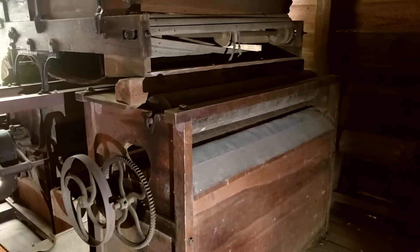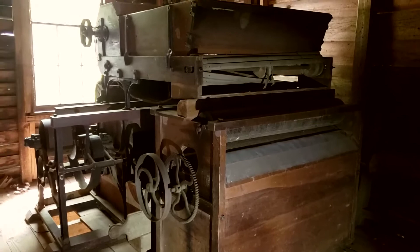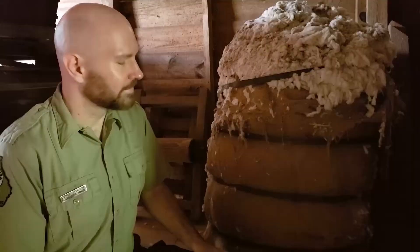The final stage was the processed lint coming into the condenser. The condenser was important because it contains small screens that removed excess air from the processed fiber. This would have been hugely important because most cotton gins would have needed a large cotton lint room because of all the dust particles that would have been emitted during the process. But this condenser would have made it so that all the dust and lint particles would have been vented outside, and the finished product would come out from the end of the condenser in nice clean sheets that could be collected and then packaged for sale.